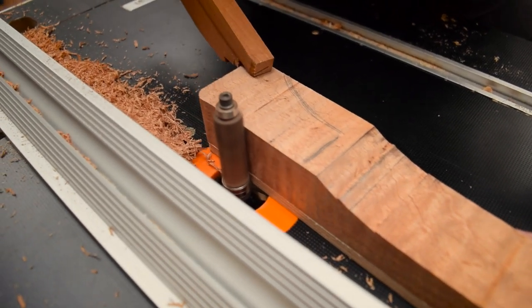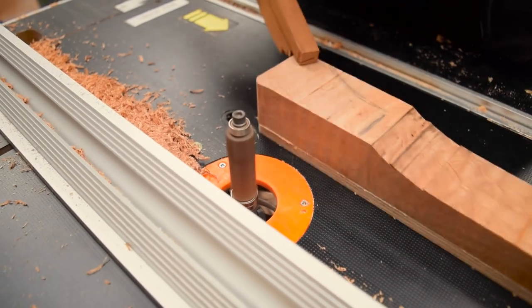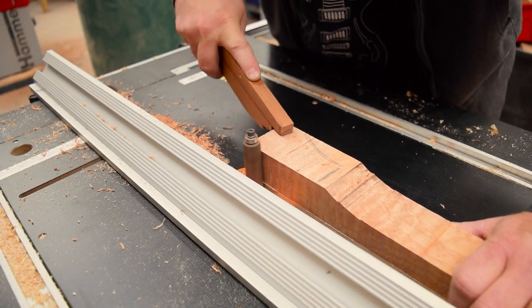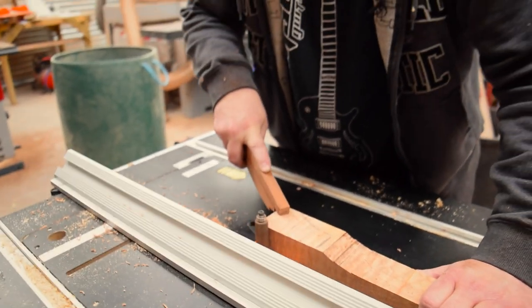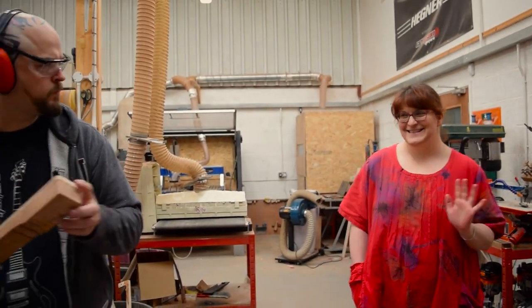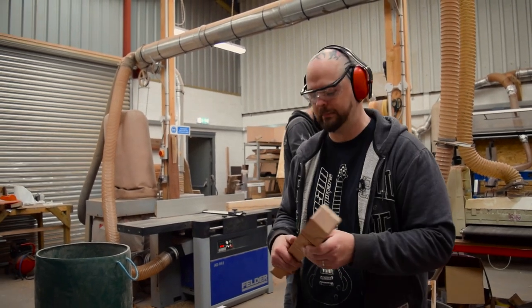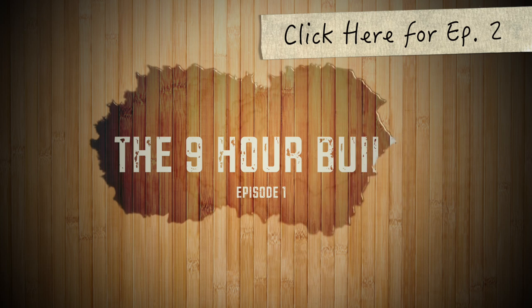At this point, I was worried about the router cutter grabbing the end grain and pulling the neck into it. So I've got a really, really hard grip with my left hand, and the push stick is pushing through. Time for the camera people to change over. 1 hour already. And there we go. Thanks for watching episode 1.